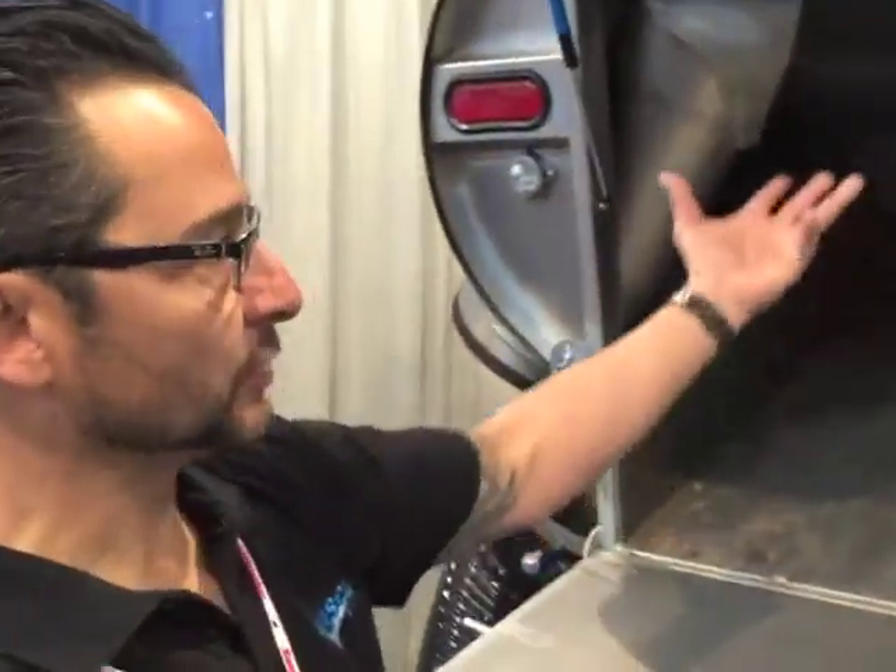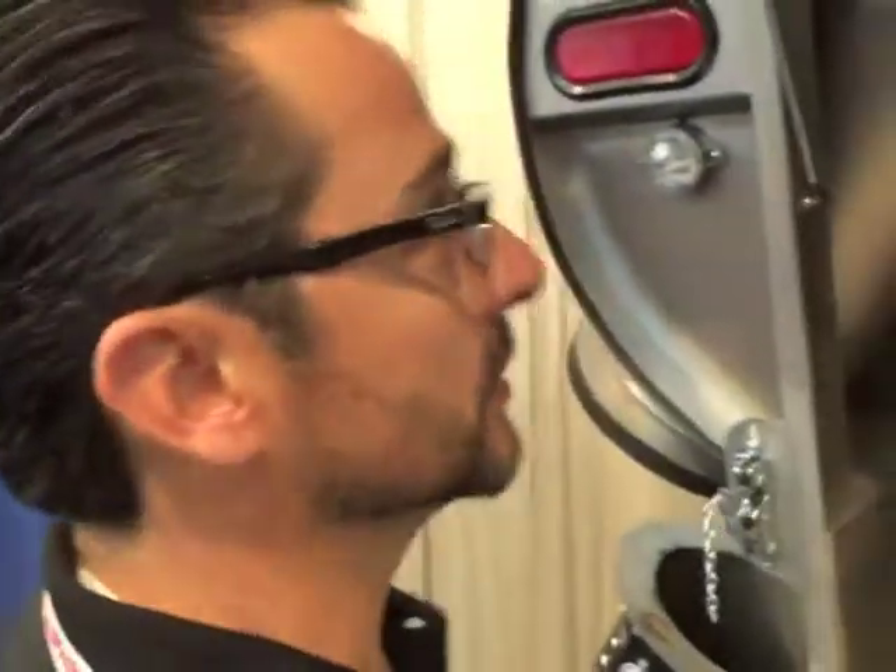Masco has always been known for a three-yard solid hopper capacity. This is full stainless steel, so it's essentially corrosion-free for life. The screen on top of the hopper has a five-inch cap versus the larger cap I've seen on others, and it has a spray system that reduces dust on top of the screen, pretty much on the path of the inlet of the 10-inch tube.